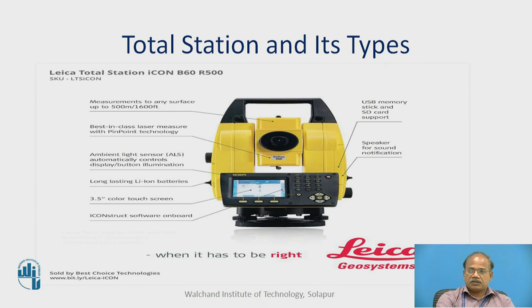I am displaying this particular instrument for your information — this is a Leica instrument, which is very smart. When doing the temporary adjustment, we make the vertical axis of the instrument truly vertical. You can see a spindle here; at the bottom of the spindle there is a clip, and from that clip a plumb bob can be suspended from the bottom of the instrument onto the ground. For centering, there will be a peg or pin on the ground and your plumb bob should be exactly above that point. There will also be a circular bubble at the top of the tribrach, which can be brought to center using the foot screws or tripod legs.